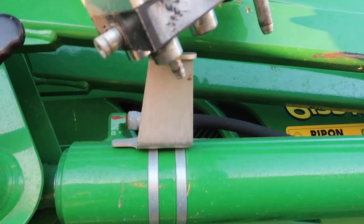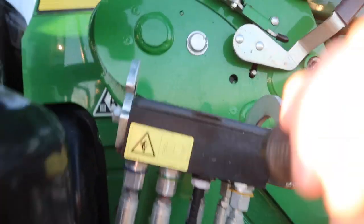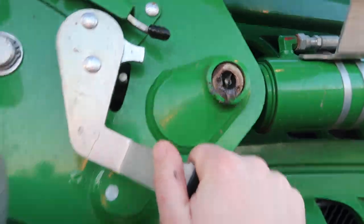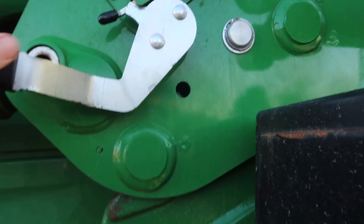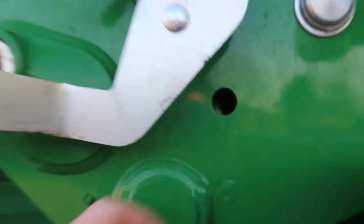The way we do that is literally just to turn the tractor off, release the pressure, and then we can disconnect the hydraulics. I've just rested them in that little bracket just there, and then I'm going to close the lid and shut the little lever down — it's now locked in. Then we can begin the disconnection process. Pull the lever down to unlock it, then push that little indent there and pull it down — and you can see that the little black lock in there has now gone forwards.